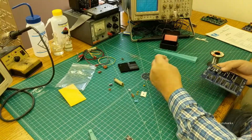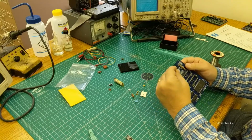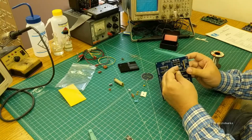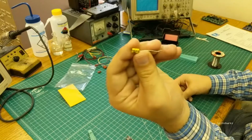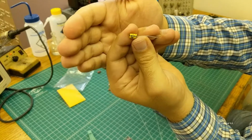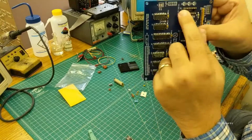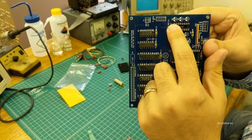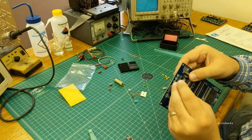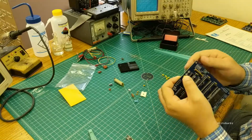And we'll go ahead and do the yellow capacitors. These are 22 microfarad 16 volt, and those go around the MAX232 right here. The negative stripe, which is the little black ribbon with the little arrow with the stripe there, goes toward the solid portion of the little symbol on the silkscreen there. So you want to install it with that negative stripe down, and that is the same for all of these.